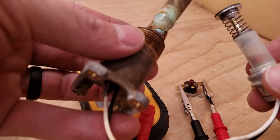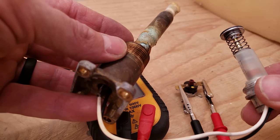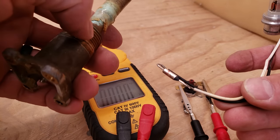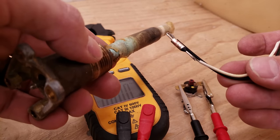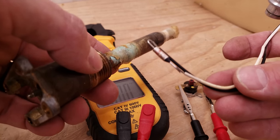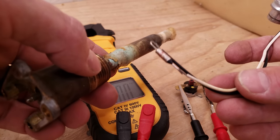In reference to the fuse located in your temperature sensor — this is actually in your water tank — this thermal fuse should not pop and open up unless there's no water in your tank. If there's a leak and the water was shut off, it's making sure the gas and flames are not going to turn on when there's no water in the tank to absorb the heat, which would be a dangerous situation.